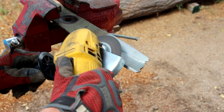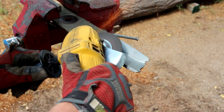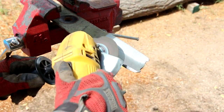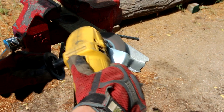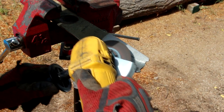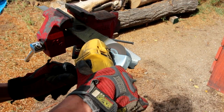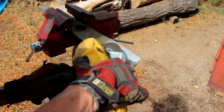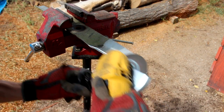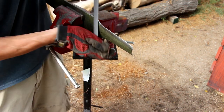Using the grinder is really not all that different from filing by hand. I'm going to make a couple of passes to find the right angle, then continue making passes doing my best to maintain that angle. Just like with the file, I'm sharpening every area that had an original factory bevel. You don't have to go crazy pushing really hard — you'll end up with low spots and high spots. Just make a nice, even pass across the surface of the cutting edge. If you've got a tricky curve or contour, it's okay to make a couple of extra passes. Continue grinding until you get a nice, smooth, even surface free of nicks and gouges. I'm still going to remove the burr with a file afterward.